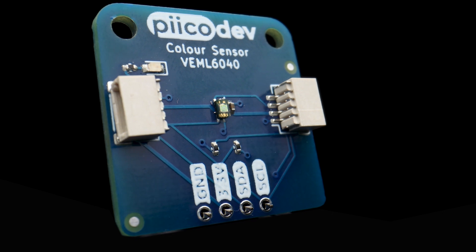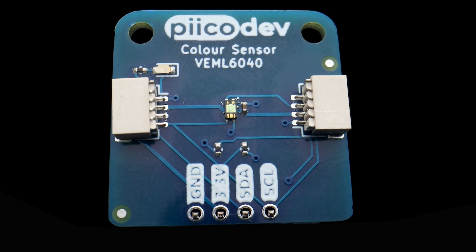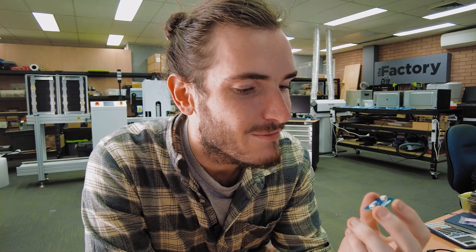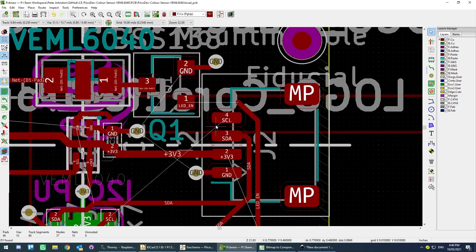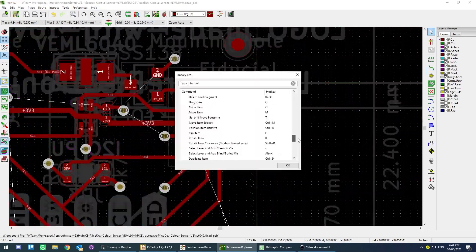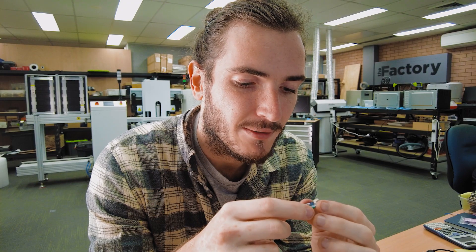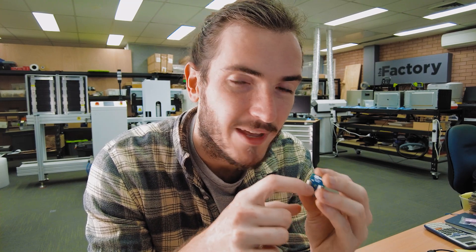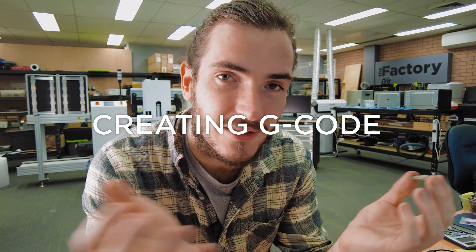While we're talking prototypes, we're also working on the PkDev color sensor. This uses a VEML6040, which you may recognize as a cousin of our ambient light sensor the VEML6030. This one reads channels of red, green, and blue, and you can infer some color temperature from that as well. Really all I'm looking for is to hold an orange in front of it and have it tell me that it's an orange or a banana — make it a fruit sorting machine. We are taking this prototype to another iteration because we want to place a high CRI LED on the board so it can read colors passively from a reflected colored surface, not just bright colors from a light. We're picking a high CRI LED so that it's color accurate.